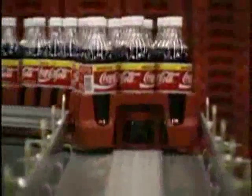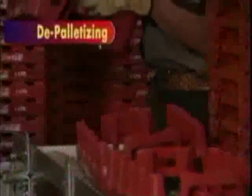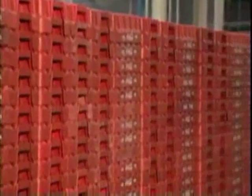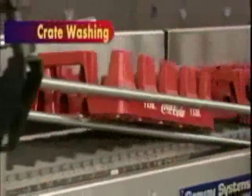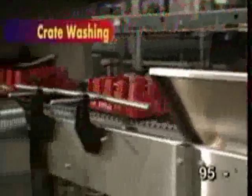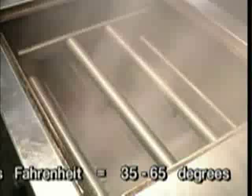These adjustments are minor but important to a smooth running production line. For depalletizing, both manual and automated depalletizer systems work without sticking — just feed the Merchandiser in stacked colors. For crate washing, to achieve optimum cleanliness, wash crates in water temperatures ranging from 95 to 150 degrees Fahrenheit. Using water hotter than 150 degrees could result in softening and deforming of the crates.